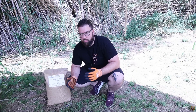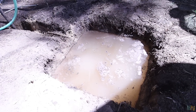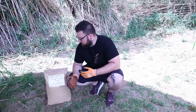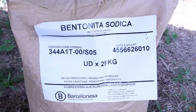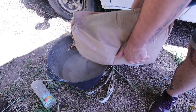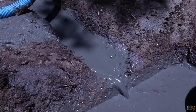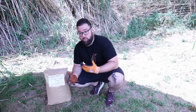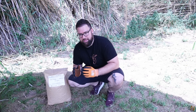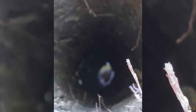When we are making the drill we use a lot of water, but this water needs to be a little bit thicker. For that we add some sort of polymer — in this case I found sodium bentonite. I'll leave a list of other materials you could use in the description below. This makes the water thicker so it can push upwards all the dirt, mud, and small stones. Besides making the water thicker, it will also seal the walls of the well so it won't collapse. So it's very important to have this kind of polymer in the water.